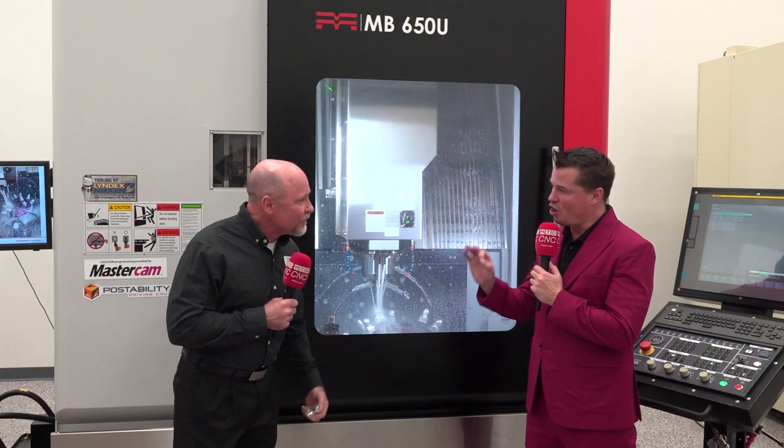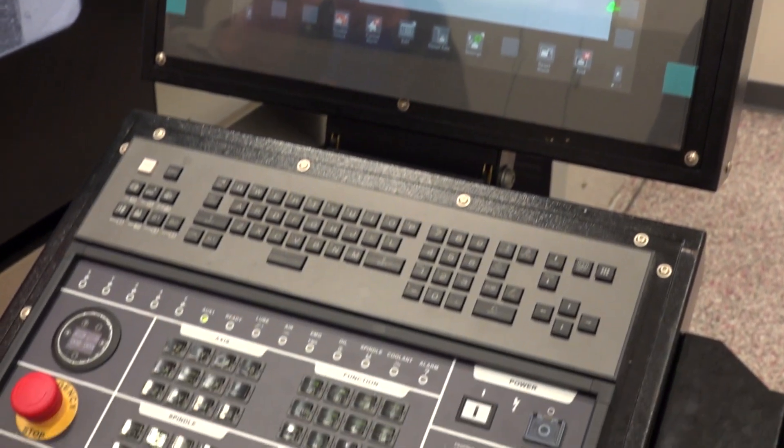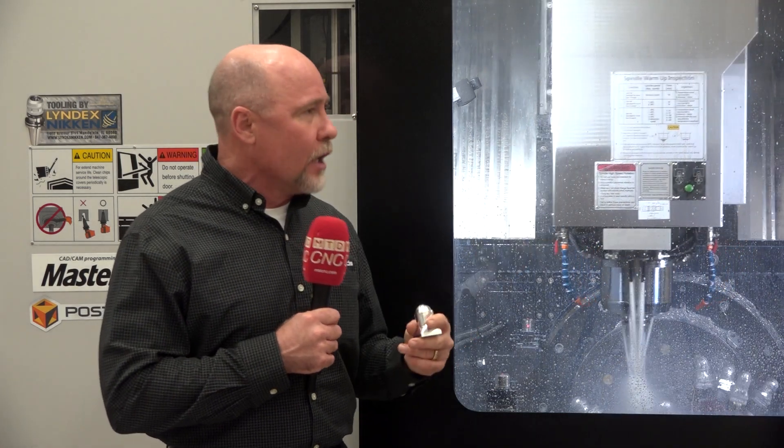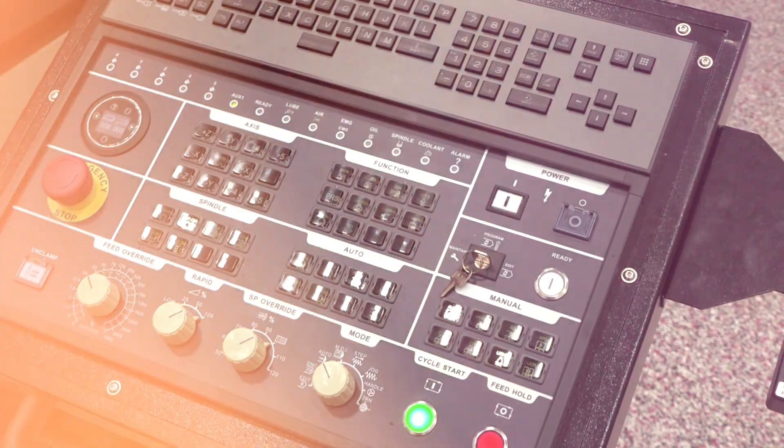Great finish. HRV3 Plus — what does that actually mean for the customer? What it means is you're going to produce a much better surface finish while high speed machining. Is this something unique to the Methods machine? Nope, it is FANUC software, but it's what allowed you to create the finish that creates that shiny helmet. It's a great option — it's a standard feature on this control. I believe on most of their 31i controls, it's a great feature that people should be using.